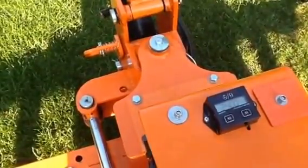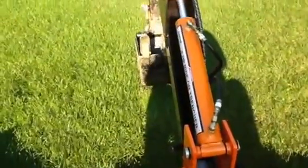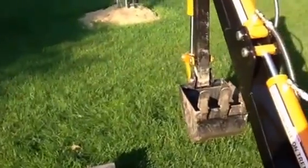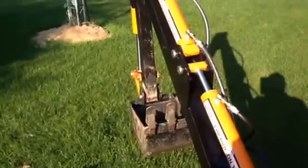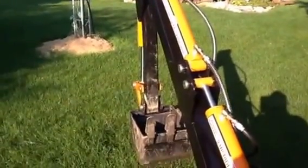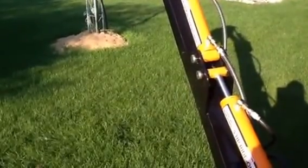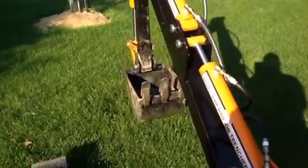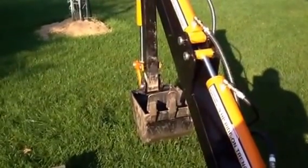I'm running it right around 2400 RPM, as you can see on the gauge. If you count that, it's about six seconds up and about eight seconds coming down — a little slower on the way down. And notice how fast it popped into bypass — just that fast, just a little squeak.